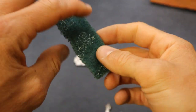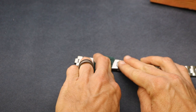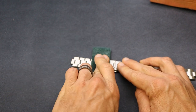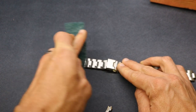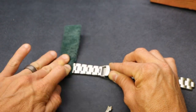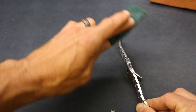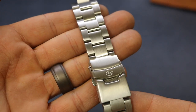The next step is what I call the final finish. I switch over to a straight linear motion in one direction only — no more back and forth. Starting at the top of the bracelet, I work all the way down in one motion. This gives you the best brushing result. You can do this as many times as you want; I do it for just a few minutes to achieve a slightly finer finish.